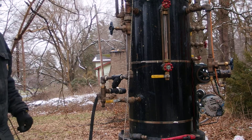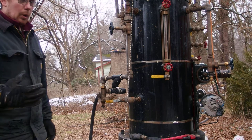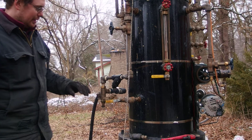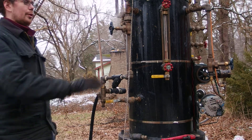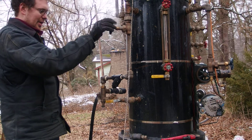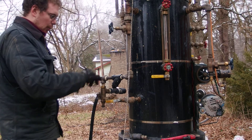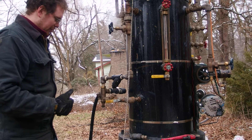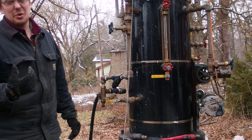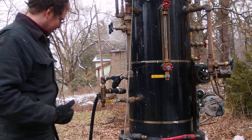Watch the water level rise. If this starts to spit, you want to give a little more restriction on the water — though not all injectors will work that way. Other ones will require a reduction in the steam. This can, in some cases, be oversteamed, or it's just user error. That's my interpretation of how it's operating.